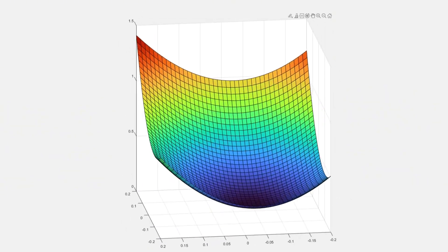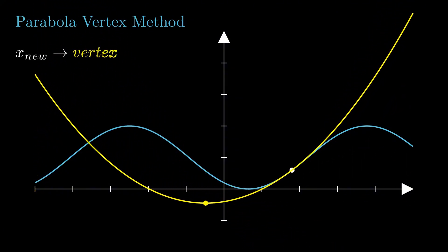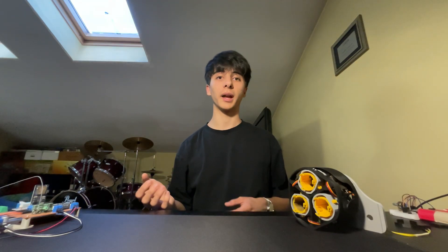The first thing I needed was a faster converging method. By studying the distance function graphically for two parameters, I noticed its shape was really similar to a paraboloid. So I decided to approximate this function to a second-degree polynomial, and at each iteration approximate the minimum to be the vertex of that parabola for each of the six angles — which turns out to be Newton's method applied to the derivative of this function. Also, since we work with rather small angles of about 10 degrees, we can replace trigonometric functions with their Taylor expansion, making the computation much faster.